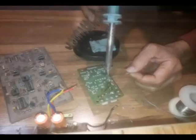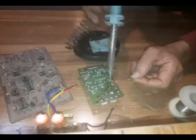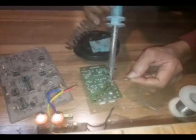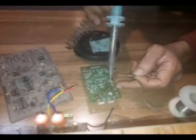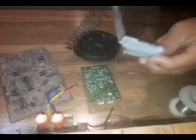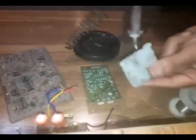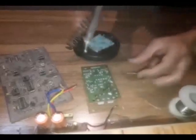The soldering iron tip is produced in different models. The tapered tip is the most common model on the market and is used in projects that require a high level of finesse. It can also solder small spots well without damaging other parts. Chisel tip models are also wider and are used for soldering large parts and pipes.